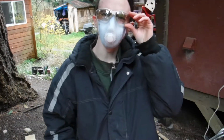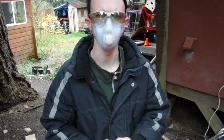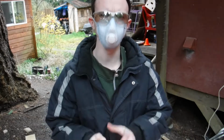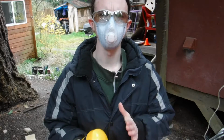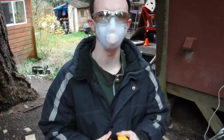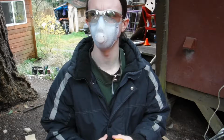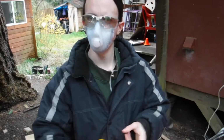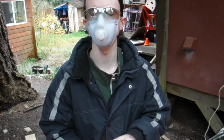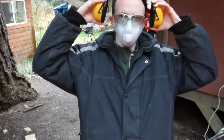Well, with what I was doing there, the wood just wasn't strong enough, and the force of every now and again a little jerk from the blade was just cracking it, and that was ruining all progress. So I stepped back from cutting it down the middle into two thin 1/8" pieces, into cutting it down the side, taking just an eighth off and going down to a 1/4 inch, which I tested and seems to be quite flexible and a lot more rigid at the same time. So once I do my lamination, it'll be stronger in the end. And I'll have some grain going this way and this way. It won't just be all going this way. I think it would have probably cracked really easily. I never thought about that, but it's good. Progress is in the right direction. Here's how I'm doing it.